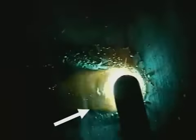The molten slag will run down, covering the bottom, but watch the top side of the puddle. Move fast enough to avoid excessive weld buildup.